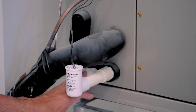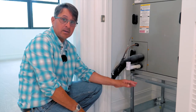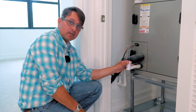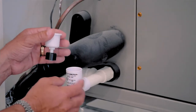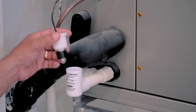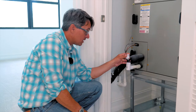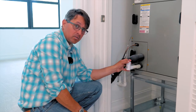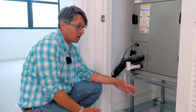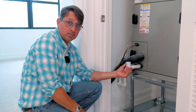At your air handler there is a condensate line. This line runs to the outside of the home and we will show you how to clean it. If this condensate line gets clogged or backed up, it will cause water to fill up in here, which will cause this float switch to rise and shut off your air handler. This is a safety mechanism so that water does not start leaking throughout your home. This is a homeowner maintenance item — you will need to purchase a small vacuum from any hardware store and suck out the condensate line, which we will show you how to do outside.